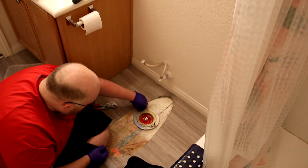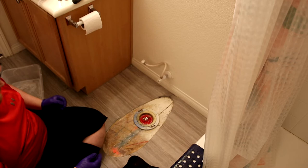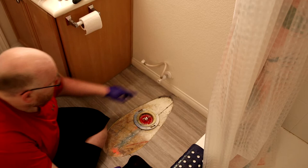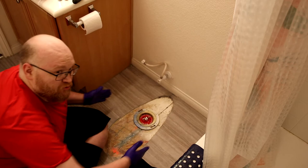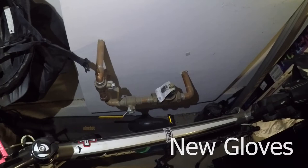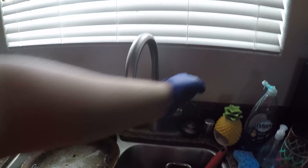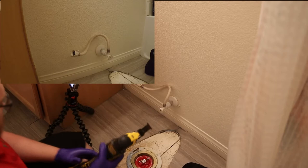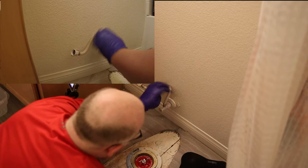For my toilet — my toilet is a big bowl — this valve needs to be directly in the center and about 10 inches up or 10 inches off to the side. If I leave it right here the toilet will literally crush it, so I'm going to have to move this valve. Since I'm going to be cutting into the wall, the first thing I want to do is turn off the water supply. The bathroom I'm working on is above this faucet, so if I turn on the water here it's going to drain out the line so I don't have to worry about there being any pressure upstairs. I'm going to start by cutting around the area and see what's actually behind this wall.